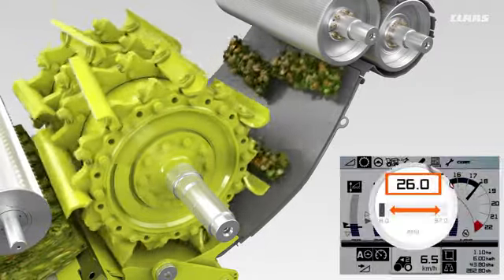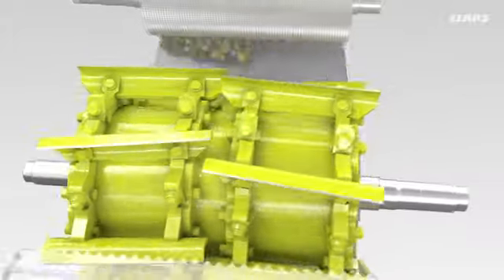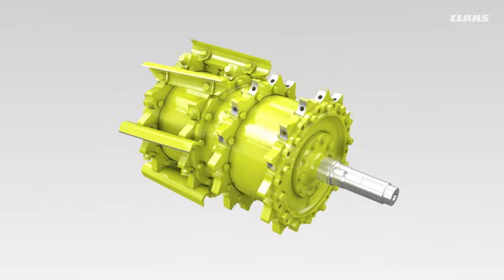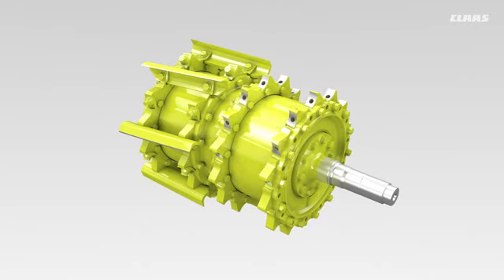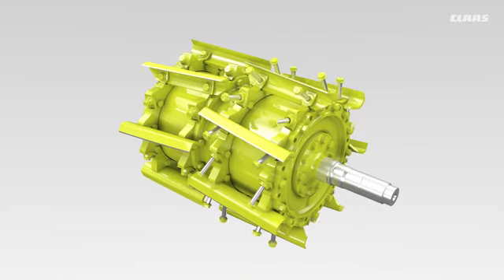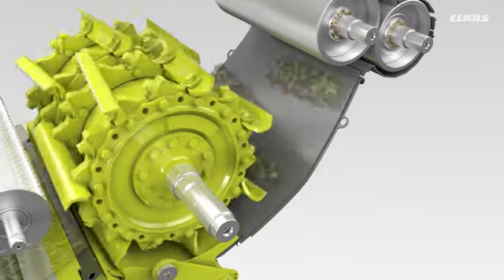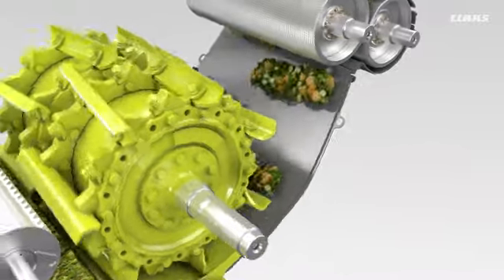With this knife arrangement, it is clear that the chopped material is not discharged symmetrically. This knife layout is recommended for grass harvesting only — it is not approved for use with a corn cracker. The new V-MAX cylinder now provides the option of adjusting the position of the knife carriers so that use of half the number of knives produces a symmetrical crop discharge. This enables approval for use with a corn cracker, which is therefore now able to process the crop extremely consistently at chop lengths of up to 30 millimeters, as in the case of Shredlage, for example.